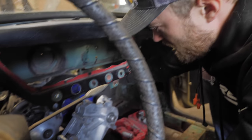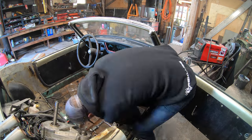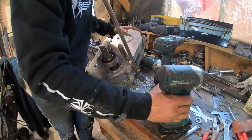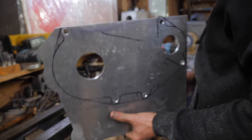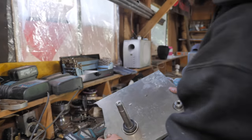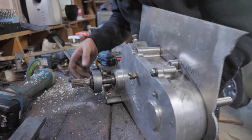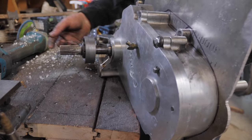Now I'm working on making a mounting bracket for this whole chain case, which has to be super duper strong. Here's the beginnings of this mounting bracket — it's quarter inch thick aluminum, nice and sturdy, nice and lightweight. This is just the base plate that'll bolt on there, and then I'll weld all sorts of supports onto it to attach it to the chassis. Afterward I'll add in a bracket that supports this bearing, which I'll probably tie into here on this side, and then from here I'll make a nice sturdy bracket down to the frame of the car for extra support for everything.